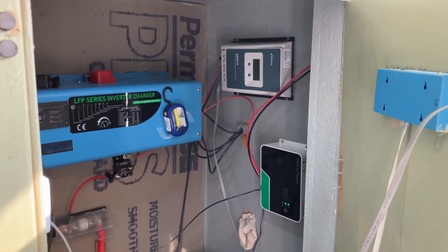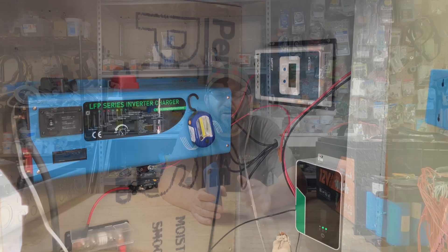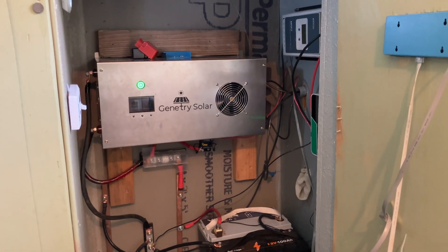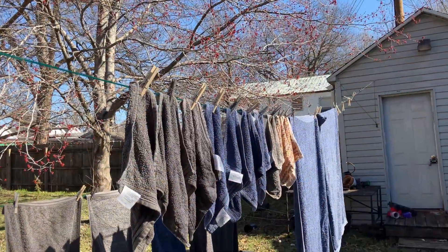Yes, you can run a dryer on a medium-sized solar setup, but why would you want to? The Sun Gold Power can do 4,000 watts continuous and maybe eight or twelve thousand watts surge — it just couldn't handle it; too small. That dryer takes 4,600 watts to run, not surge, but to run. My Genitry Solar, which is a 6,000-watt beast, can handle it, but even that was pushing it at about 80% and it's going to stress out my batteries. That's a 10,000-watt-hour battery bank and I'm only going to be able to do two loads of laundry. You'd have to build a massive, massive system to do something this silly when you could just run a clothesline in your backyard.